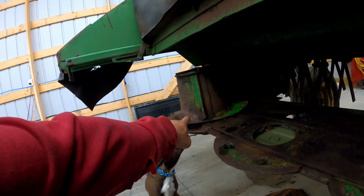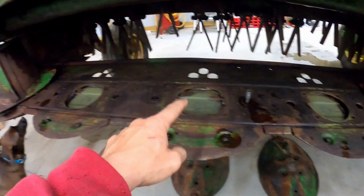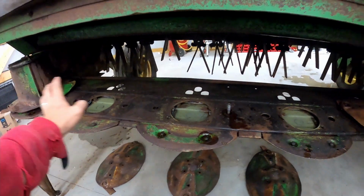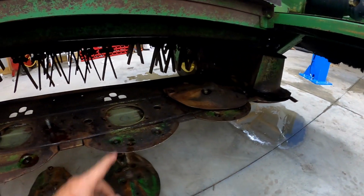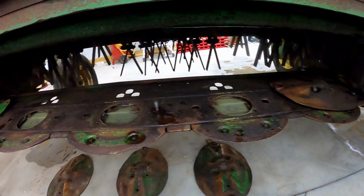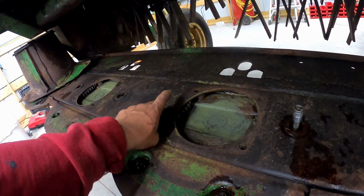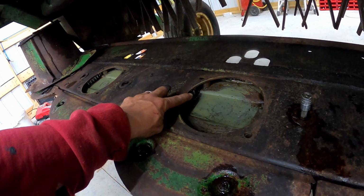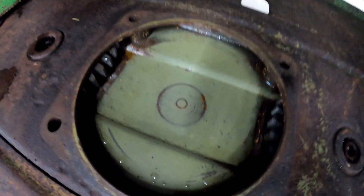This is what we cut our hay with. Just like you see this turtle right here, there's actually one all the way across. There'll be one there, and one there. All 6 of these turtles run in opposite directions so that they don't interfere with each other, and they're controlled by these idler gears, is what I would call them. I don't know if that's the technical term, but this gear right here spinning connects this end down here.